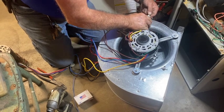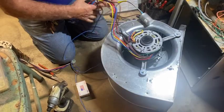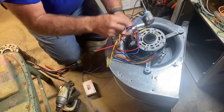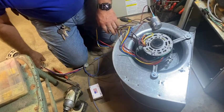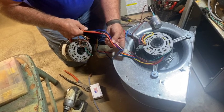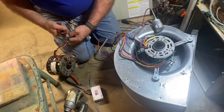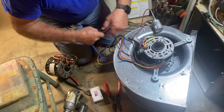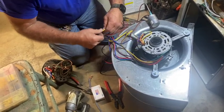We're going to change this capacitor. I've got a new 10 microfarad capacitor in here — it's a flat one. So we've got to tie this into the old harness. According to the wiring diagram, yellow is common, this wire is going to be low, this one medium, blue is medium, and black is high. That's fairly standard with most universal replacement motors. If not, it'll have an additional color like orange for a medium-high or medium-low speed, and sometimes white for common. We have to cut off the old lead and wire in the correct colors to plug back into that Molex connector. Yellow goes to white on this particular one.